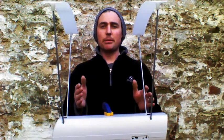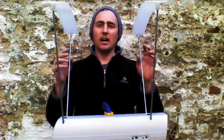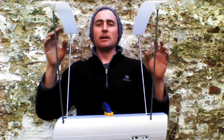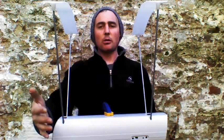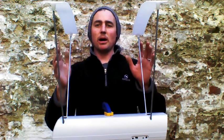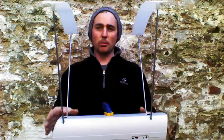If you're shooting inside, my recommendation is that you use LED strip lights. When you look at the manufacturers' lighting kits, which can cost stupid amounts of money, all they are is a strip of LED lights which you can get for under ten dollars off eBay. You just need to put two strips on the back of your diffusers, and they run off a laptop PSU or any equivalent 12-volt DC power supply. The bright white or warm white LED provides the right spectrum of light to allow the photo diodes to work properly.